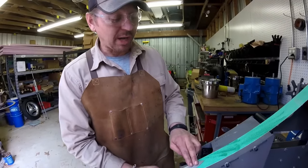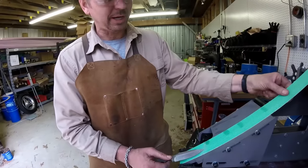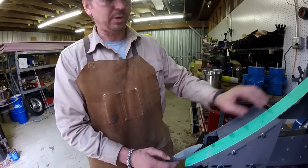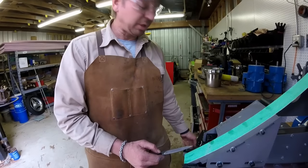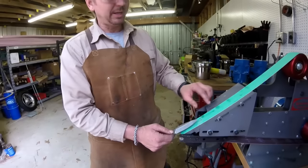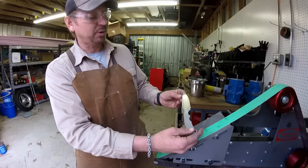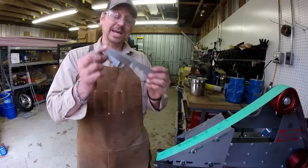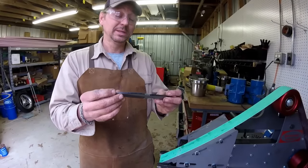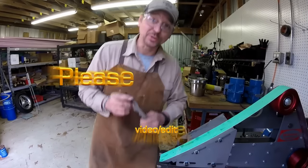You just have to be real careful when you rock the tip because you can and will bury it when the splice comes around if you're not careful. It takes a lot of practice. The last step I do is put a Scotch Brite on and run this belt backwards by putting a reverse switch on my VFD, and then I can get a perfect finish. And that is pretty much the plunge attachment — that is how it works, that is what it does. Thank you so much for coming by and seeing how I use this attachment. I really think it can help both the experienced and the veteran make a better knife. Thank you.